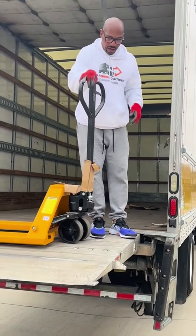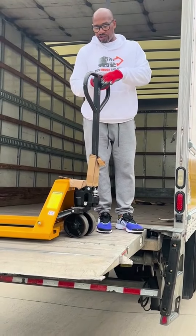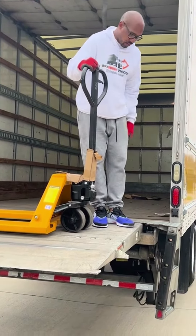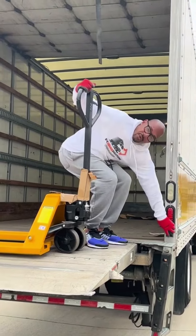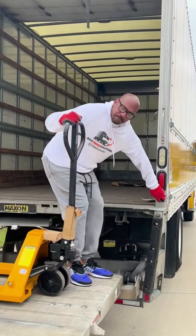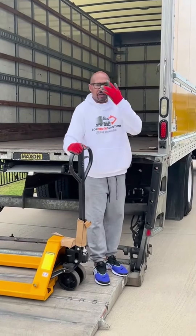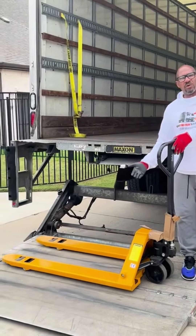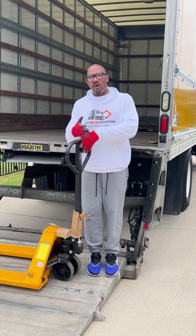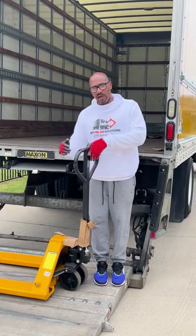So that's okay. Now you've got the weight of the load holding you secure. You let your lever down so it can be flat — you don't want it to be rolling, you want to make sure that it's flat. Now you're ready to let your freight down. Go ahead and bend down a little bit. Remember, you want to be on this side so your lever is here. Go ahead and let your freight down and now you're ready to drop off your load. You saw the pallet jack move a little bit when I started to let the lift gate down — that won't happen when you have freight because the weight of the freight will keep the pallet jack flush to the lift gate.